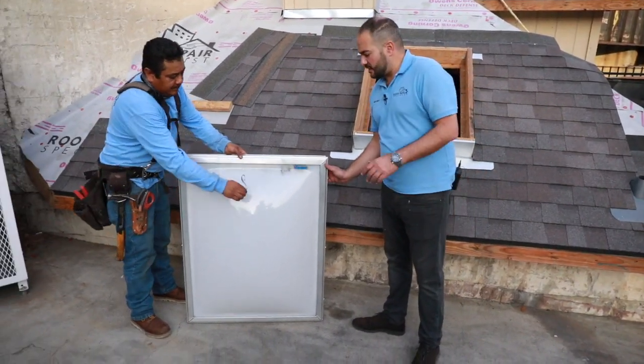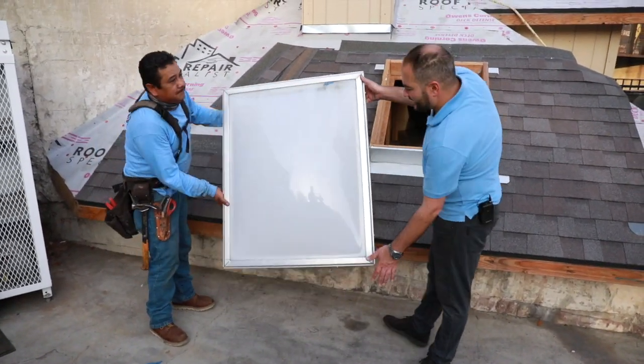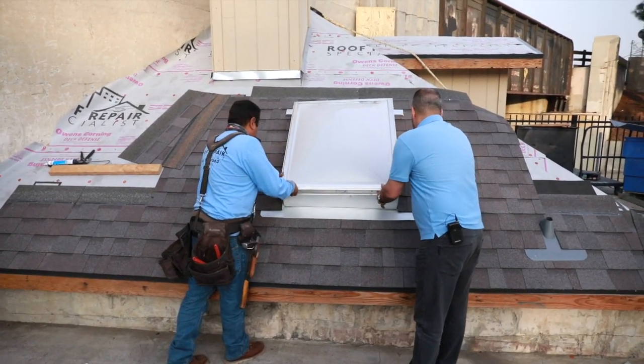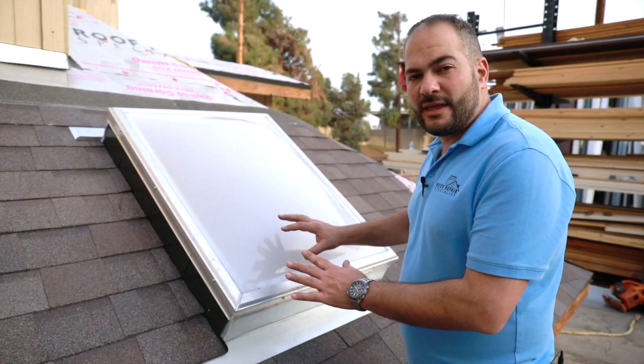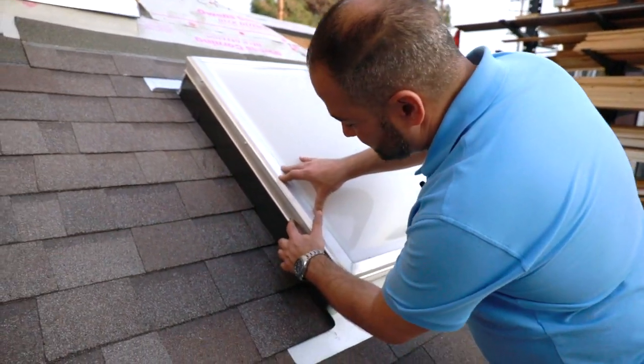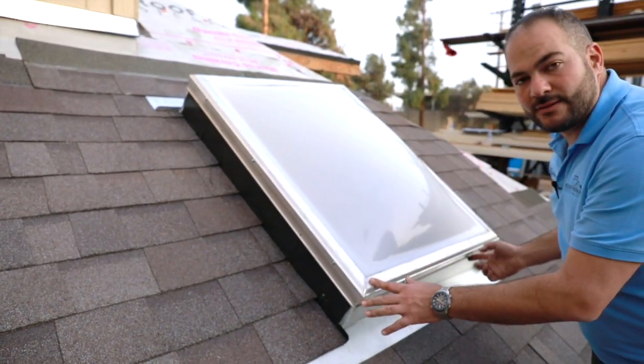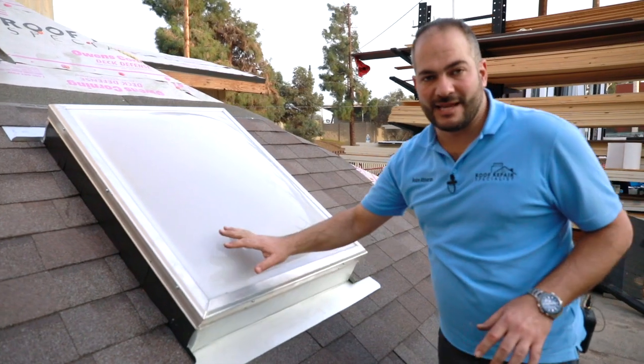The last thing we're going to do is install our skylight. The skylight that we're installing is a curb mount skylight, so it's going to sit just right on top of our existing flashing. Now that we have our skylight on, the last thing left to do is install screws or nails here — we recommend screws all around and you are good to go. Your skylight is properly flashed and this will last you for years to come. Thanks for watching. We've got a lot of other videos on shingle roof installation. If we're missing something, let us know — we'd love to show you how to properly do the things that you want to do. Like, subscribe, and if you have any questions, let us know below.